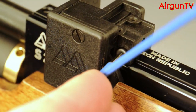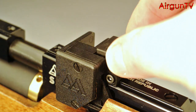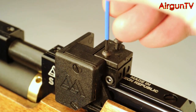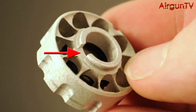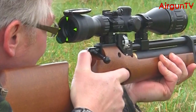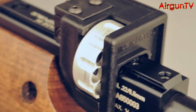Tighten up the clamping bolt with your 2.5mm hex key and then position the cover in place. Note that this small lip on the underside of the cover should be located at the back – it's fairly obvious otherwise the bolt holes won't line up properly. Then it's just a case of screwing down the dome head bolts with a 2mm hex key to secure the cover in place on the cassette. And that's it – you're done, bar a quick check that the magazine cycle is OK. To insert it, line up this notch with the lug on the cassette, and then each cycle of the bolt will automatically index the magazine and transfer a pellet into the rifling without you having to fumble with anything. Your single-shot S200 has now been transformed into a magical multi-shot, and it's definitely an upgrade I'd recommend for this classic of pre-charged pneumatic air rifles.